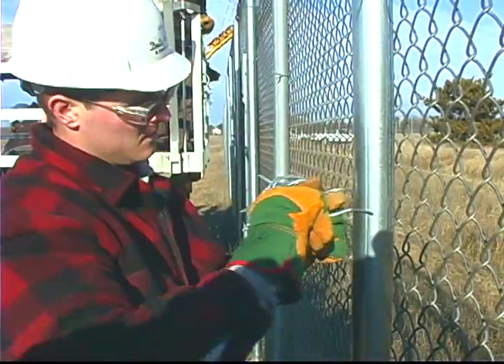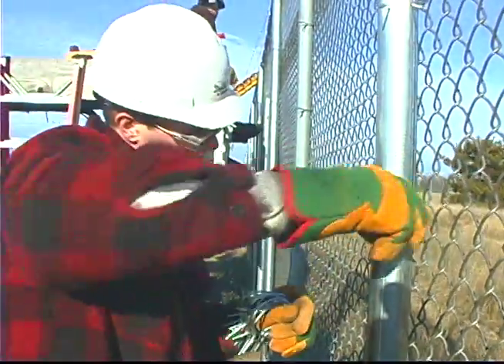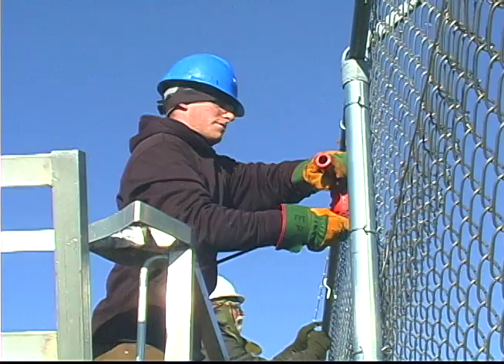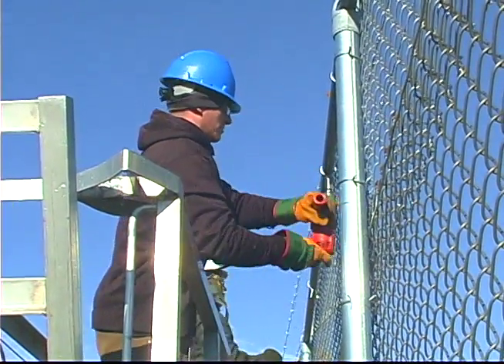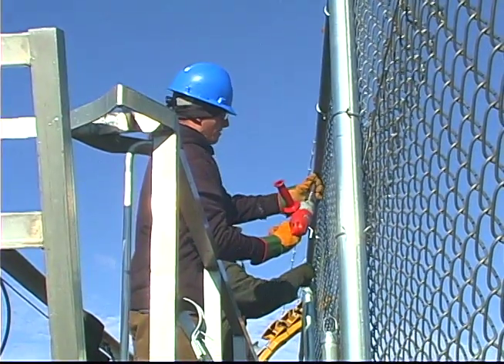The old fence had hook ties — I think they're nine gauge aluminum. A lot of them aren't holding up very good. But we're using steel easy-twist ties that are twisted with the drills. With our five-man operation, every 70 seconds we're pulling from one post to the other post, doing the barbed wire and all.